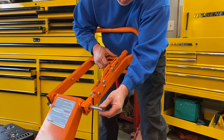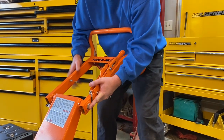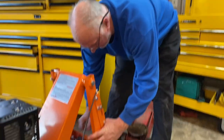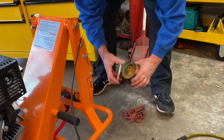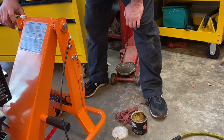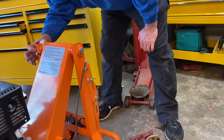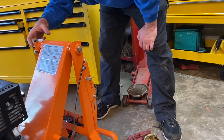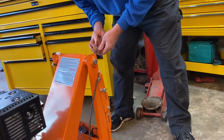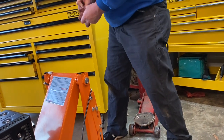It's got notches inside right here to hold it in place when you're turning. Before I put the nut on here I want to put some grease on these threads because this is something that's going to be loosened quite a bit here and there, so just to make the thread life last a little longer. We'll put a little bit of lubricant on there.